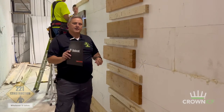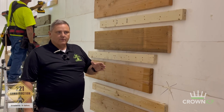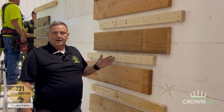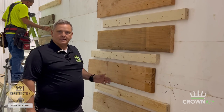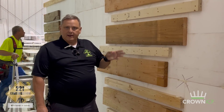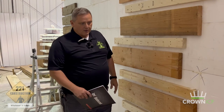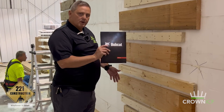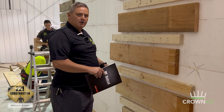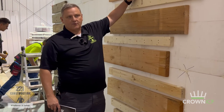This spot is a little different than the T. This is where they do what's called the makeup row. They'll have one spot in the wall — because the wall is never exactly the length of the block — where they'll cut and alternate the joints in the block so that the ribs still line up but also have the reinforcement needed over that area, so there's no blowout where the makeup rows were. The block row comes in from the corner and may not be a full block, so they cut one side and set it in, but on the next row the joint has to shift left or right. This is the reinforcement for that makeup row.